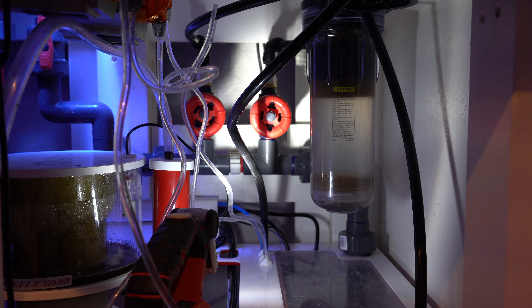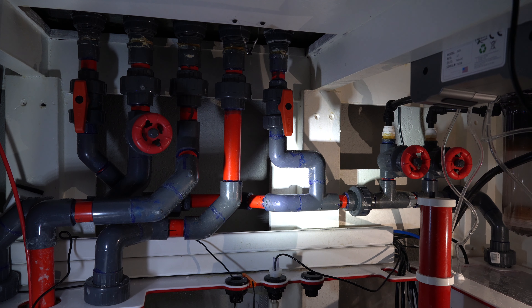The water would come up and run through my UV sterilizer and then I'd dump it back into the sump, kind of how the carbon is — the pump pulls it up, comes into the carbon, goes back down into the sump. So this water is getting cycled a bunch by the carbon before it goes through. That's what you want to avoid when installing a UV sterilizer because it's all about tank turnover. Furthermore, some of that water is going to go right by the gate valve and back into the display without going through the UV sterilizer, so it's not a true closed loop system.